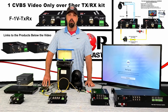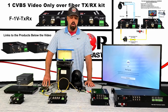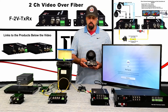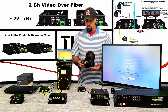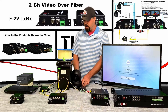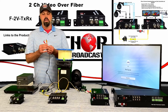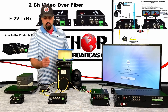I tried finding an analog camera from way back in the day that uses baseband, but we don't have one here. Showing you a newer HD camera — on a lot of these cameras you'll have a Phoenix terminal, which can be used for RS control if you have a remote control unit. We're using the yellow, red, and white composite cables coming from the Blu-ray, going into this unit over the fiber.